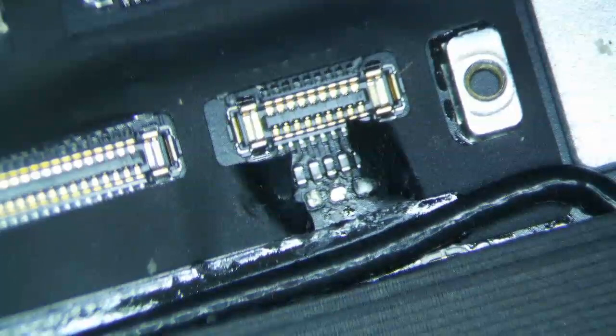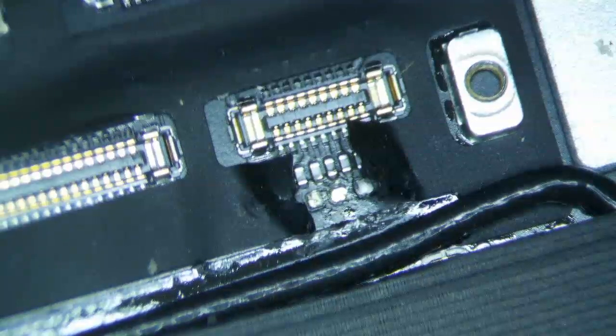So what am I looking for? I'm looking for a filter here to replace this one. Okay, here it goes. I'm using an iPad 3 4 backlight filter, and it's a 0402 240 ohm filter. I find that this one's generally good enough for just about all the backlight LCD stuff like that on the iPads.